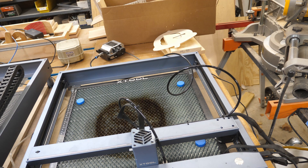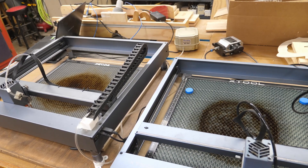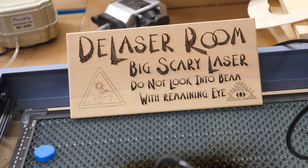I've done reviews on honeycomb boards — there's one by Jacota, some from Nibble, and one from Make Like Sun. Honeycomb board is almost essential if you're going to be doing cutting, to prevent scorching on the backside of your work. If you're doing something that won't be painted or finished, that's going to be very important. Air assist will greatly reduce and mostly eliminate scorching on the top side, whether you're doing cutting or engraving. When I'm engraving on cedar, I always have the air assist on. This cedar sign was actually engraved on this laser this morning, and as you can see, there is absolutely no scorching on the front.